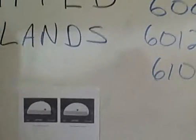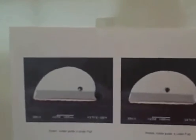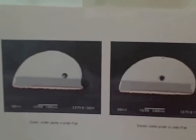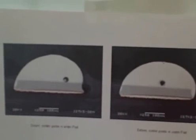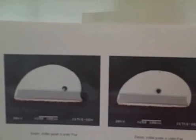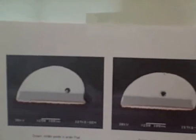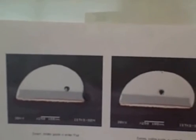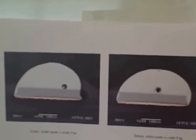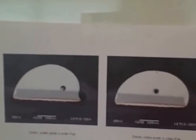What we have here is the photograph that was submitted by the member company. They indicated in showing this image — what you're looking at here is a micro section, specifically a cross section of a surface mount land with solder paste on it that's been reflowed. The member was trying to get some indication as to whether that's acceptable per the requirements of IPC A600.